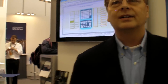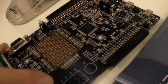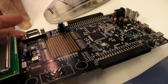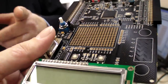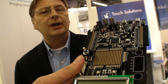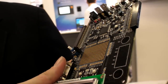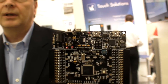Maybe the refresh rate of the video is not enough to see it. So you have another kit over here as well? Yes, we have a variety of kits. Here's another kit. This also is the PSOC5 with ARM Cortex M3 inside. It's got a place where you can get to the pins, an area for wire wrap, or you could stick down a breadboard there, solder some headers on there if you wanted to, and there's a potentiometer.